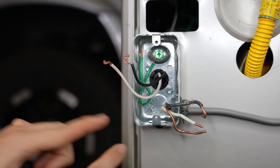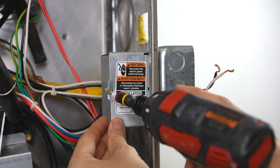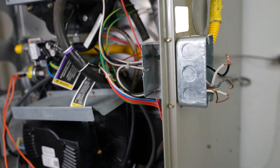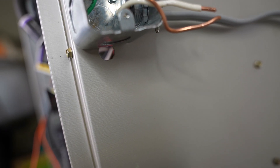Let's pause and take a quick look inside of the furnace as well. Inside the furnace, we have a little junction box. I'm going to go ahead and take the cover off, just in case we're going to be using this box too. Now what we need to do is find some kind of a hole, a knockout, or an opening where we're going to be able to stick our pigtail through. I found one right here on the bottom, right beneath the junction box — this looks like a great spot.